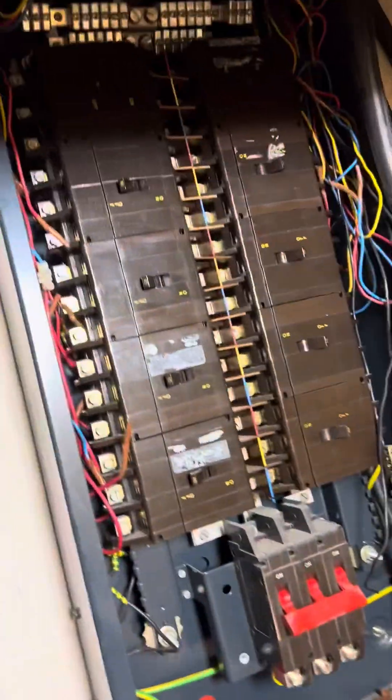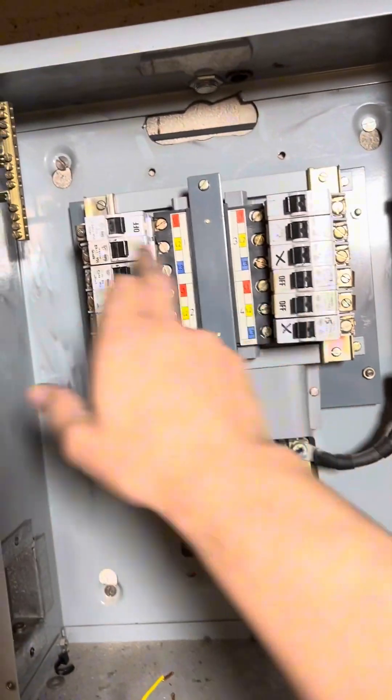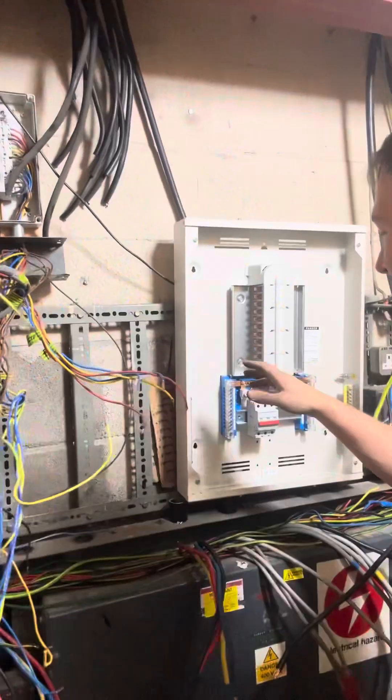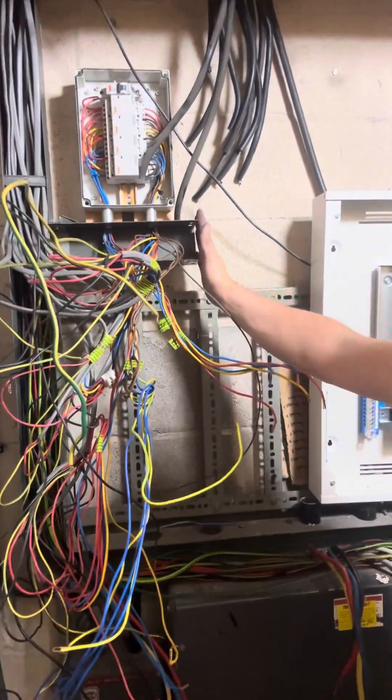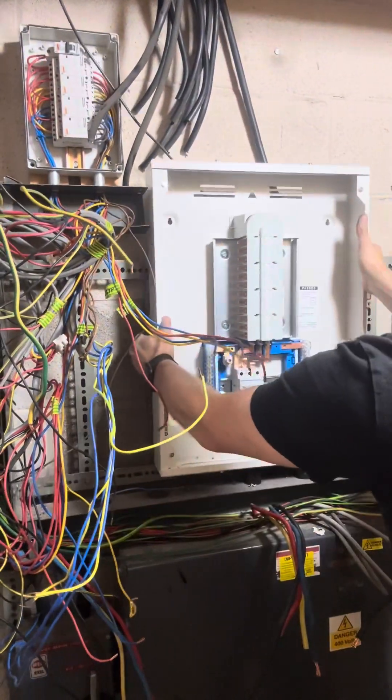Right — completely stripped out. The only circuit that needs to be kept in there is sorted, so that's just going to come off the wall now. Cut all those armours — they're all unused, disused circuits. All mine were basically joins, it's basically all for the lighting contactors. There are only two or three supplies being used and they are all single-phase supplies, run in their colours, basically just joins for the lighting. So I'm going to take this off the wall and figure out how we're going to mount the new one. It's 10:52.